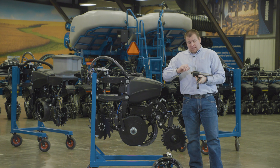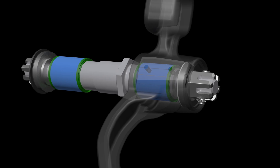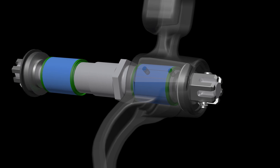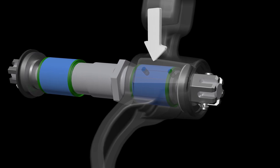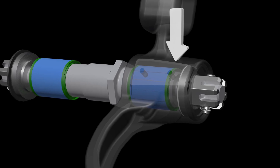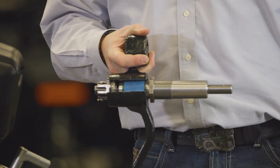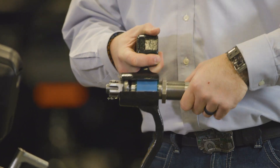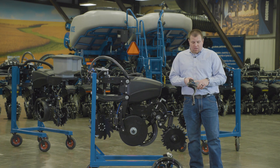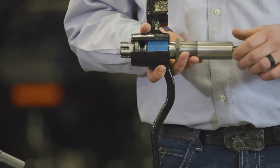It's resistant to any fertilizer damage or fertilizer spray that gets on this nut, allowing it to always be adjustable. Working our way inside, we have the larger diameter shaft, which is what the arm pivots on. We then have a seal, the fiber bushing, and then another seal to help keep dirt and debris out of the mix. This gauge wheel shaft is retained inside the row unit itself — it's a threaded shaft that threads into the cast iron 5000 series row unit.